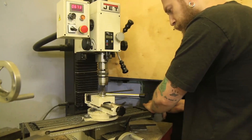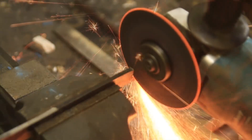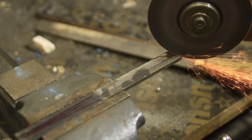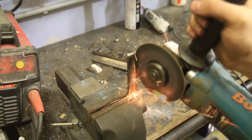Let it cool down and stick it in a milling cutter to get rid of all the humps and bumps from the blade side. We could do it with a file, considering the metal is soft and flexible. Now we've shaped the blade, cut out all the waste — it turned out to be quite long. Let's cut some of the metal to make the blade sharp, and cut it on the other side to make a tang.